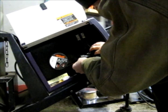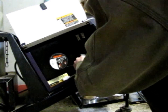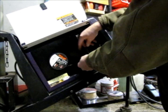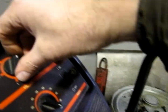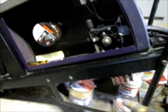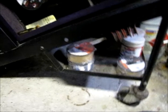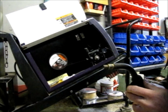Then just feed it in here — you have to lift your tensioner up a little bit. Just use all three hands. Kind of guide it in until it goes into the gun. Once you've got it in there, just push it in until you get it in a little ways. Drop that down, and I set my tension down about three turns. The voltage doesn't matter — I turn my wire feed speed all the way on, turn on the welder, and then just pull your trigger and let the feed do all the rest. I see that's slipping, so I'm going to turn that down a few more notches.